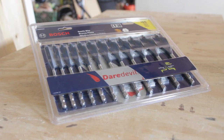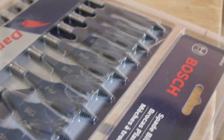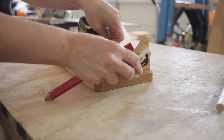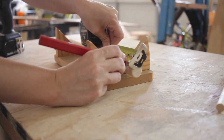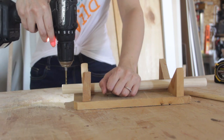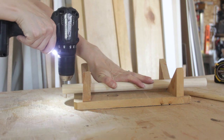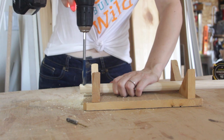To drill the two together I needed to drill some larger holes, so I pulled out my new spade bit set from Bosch. I measured 5/8 inch from my larger dowel and made a mark to indicate where the cross arm would be attached. Making sure the hole was drilled at a perpendicular angle was really important. If I had a drill press that would have been the best option, but I decided to drill a pilot hole using a 1/8 inch drill bit to work as a guide for the spade bit.